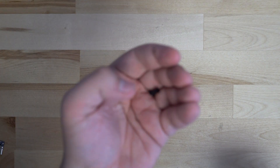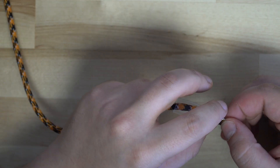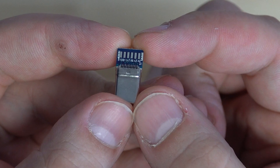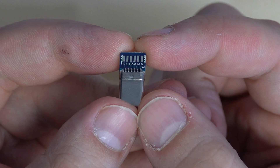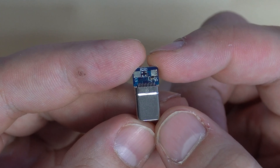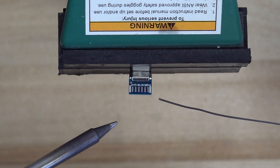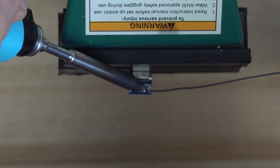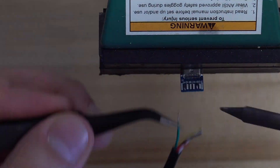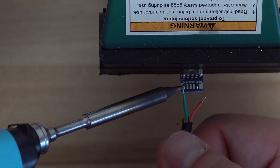Since our wire is too thick, I will not be using the small plastic piece that sticks out of the end of the plug. Instead, I will be gluing the plug together and heat shrinking the end to help fit the design of the cable. From here we can begin wiring for the USB-C end. There's one side of the USB-C header that will have two pads and the other should have six pads. We'll start by tinning the pads that we'll be using — in this case pads B11 and A2 on the side with the six pads.